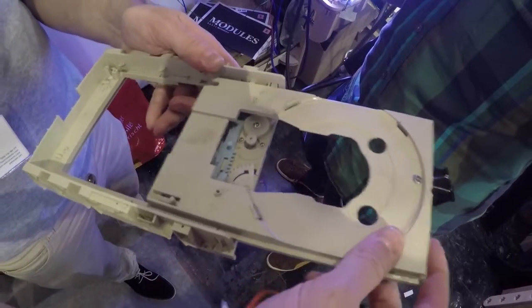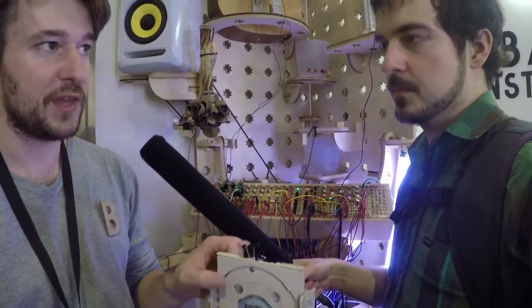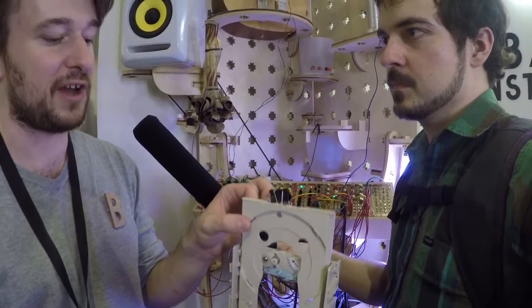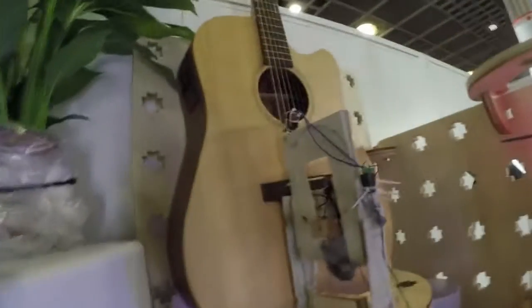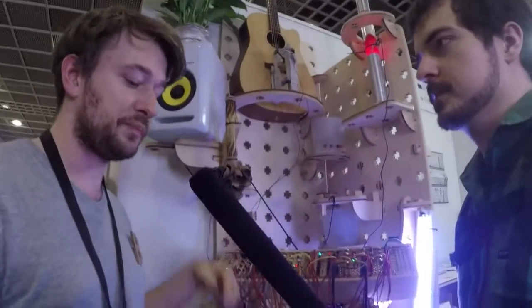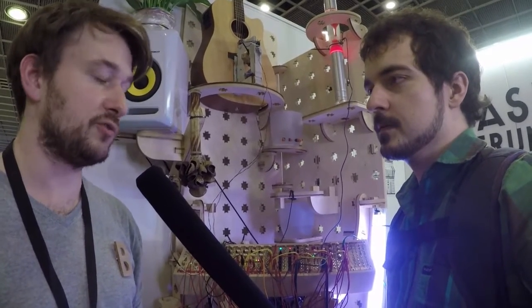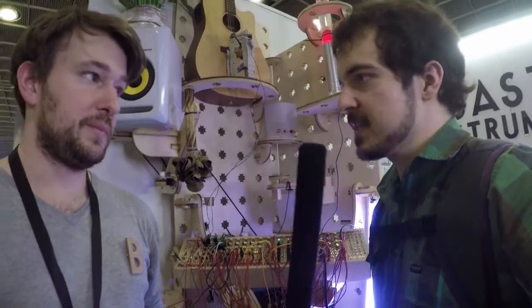You can control the speed — or more accurately, the strength — of the motor. If it needs to fight gravity with less strength, it moves slower going up; with the same strength going down, it moves faster because of gravity. I was also using a fan before to make wind, and you could really control how much wind it produces by controlling the motor strength.